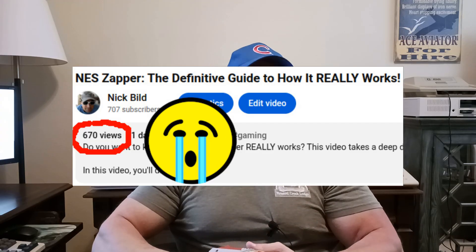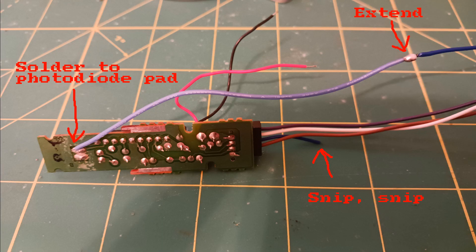If you haven't seen my NES zapper teardown video, join the club. But if you had watched it, you'd know all about the anti-cheating mechanisms that Nintendo put into this gun so that you can't easily repurpose it. But using what I learned in making that video, I bypassed those measures by directly connecting the hit indicator signal to the photodiode. Because of this mod, the hit indicator now gives me an analog signal representing the intensity of the light striking it. This means I can encode audio into light by modulating its intensity and shine it at the zapper.